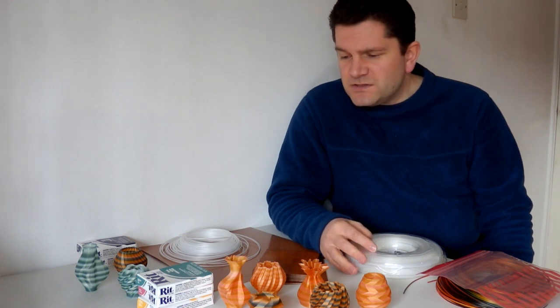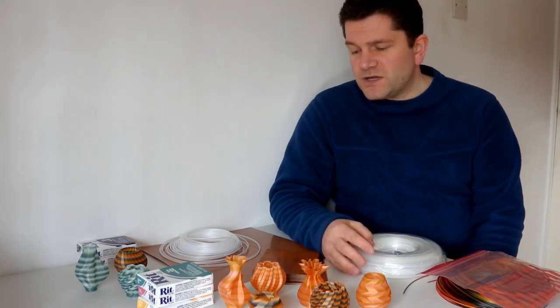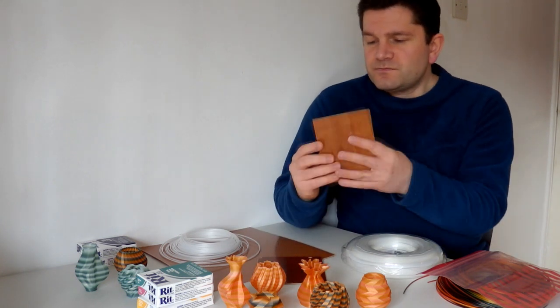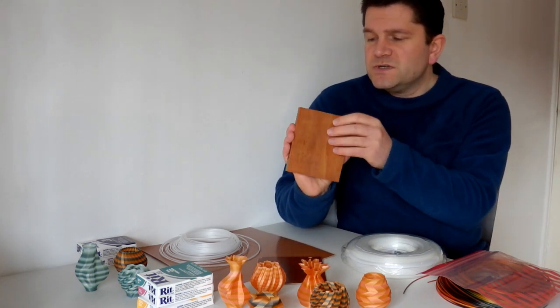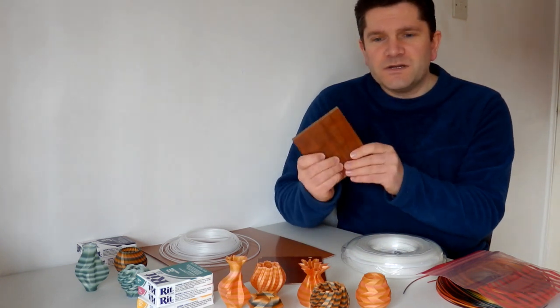One of the things to note is that you don't need a heated bed to print on. You can actually just print on blue tape, or anything sort of cellulose-based — so wood, various woods. You can print on these types of laminated woods, which are pressure laminated with resin, and they work really well, although a little bit heavy.